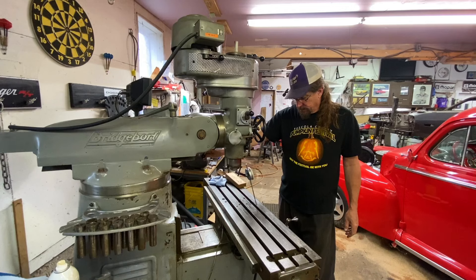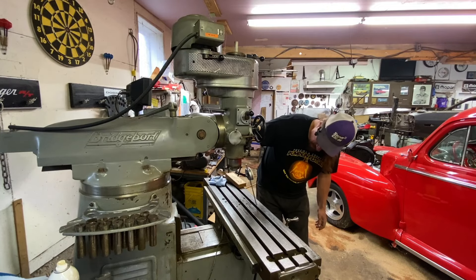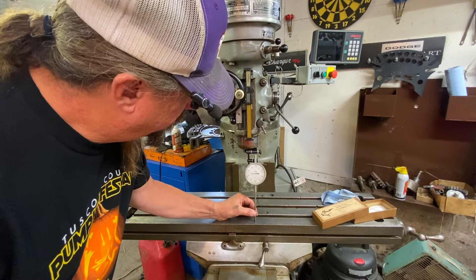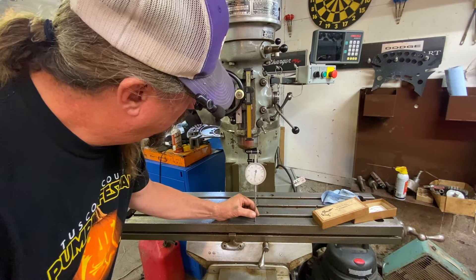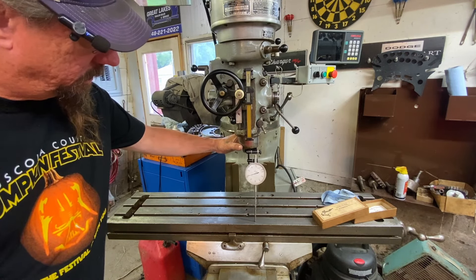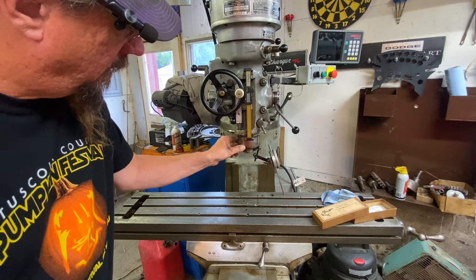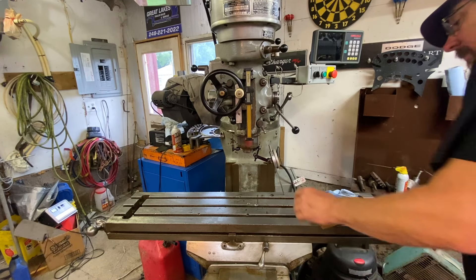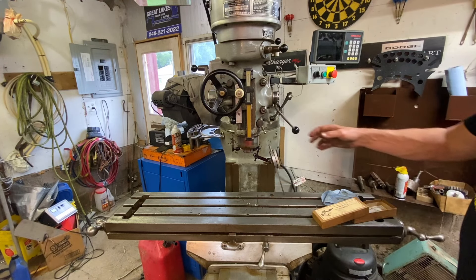My indicator has got an issue — it's sticking a little bit, I don't like that. So we're zeroed out here now. My throw is way too much but it'll give me an idea anyway, even if I can't check it completely. We've got about 40 thousandths there, I think. So let's bring that back.